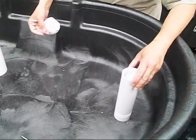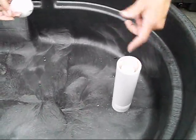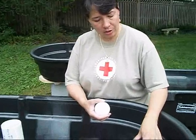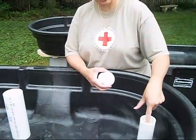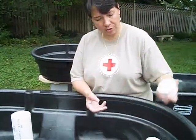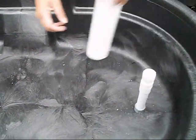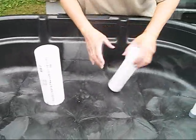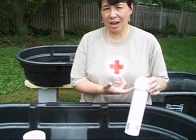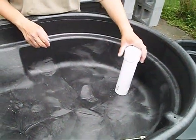And you'll see, before I put the cap on, how there's plenty of room around that upstand for the flow to get around. Then we just put a cap on — I had cut this to be 10 inches in length, so that upstand with the 5½ inch piece of vertical pipe stands to 9½ inches. Now we're going to put on this 2 inch cap and just shove it down solid. It'll be really hard to get that off, and that should be enough. You shouldn't have to put any kind of goop on here to make that airtight — it should be plenty airtight the way it is.